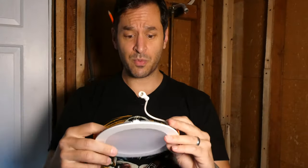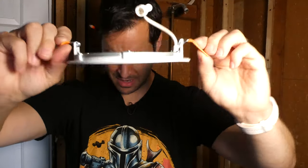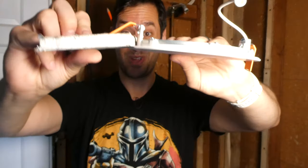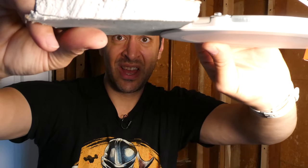So I picked up this cool LED wafer light that is rated for wet and dry areas, meaning that I can put it into my bathroom. What this does is you pretty much cut a hole, run some wires, and then pop this in the hole. These little clips here hold it in the ceiling. You get clips like that — and as you can see, it sits pretty flush against the drywall. So in essence, this should be relatively easy to do without damaging the ceilings too much.